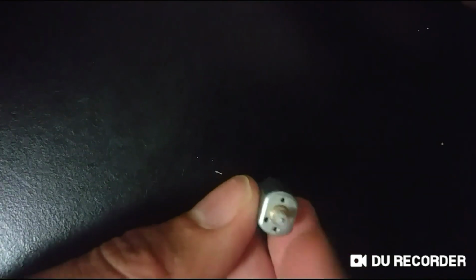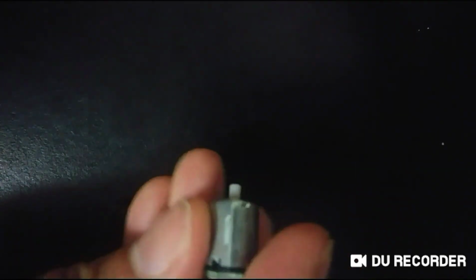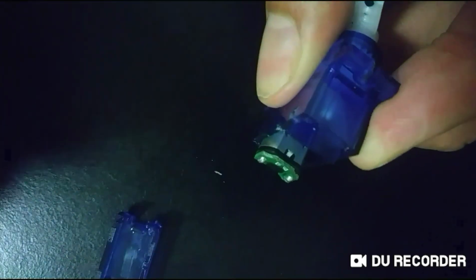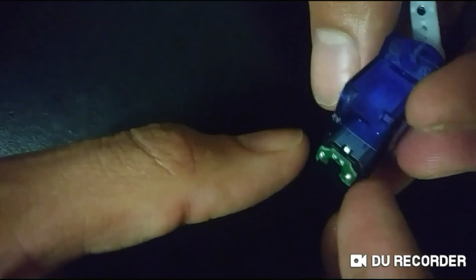These are regular hobby motors, so essentially with a hobby motor you can just follow along exactly as with the servo motor, as long as you understand that the motor inside your servo motor, the motor attached there, should typically be a DC motor. And if you don't spend some exorbitant amount of money on it, it will pretty much always be a DC motor.